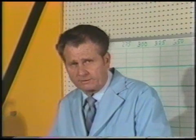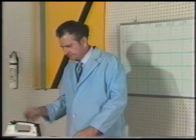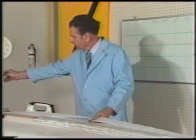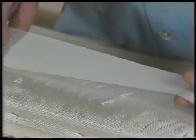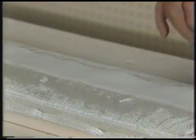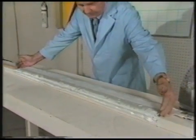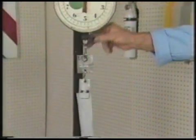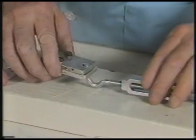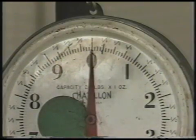To verify that statement, I'll demonstrate some of my standard evaluation tests. The first demonstration with this test rig will be fabric tension at 25-degree heat increments starting at 225 degrees. This 2-inch wide strip of fabric is styled D103, and the iron contact area is exactly 50 inches long. The tape routes under a roller to pull directly on the dial scale. All slack is removed by adjusting the turnbuckle, and the scale still indicates no tension.